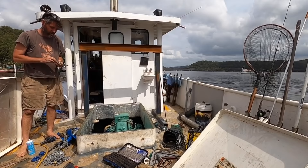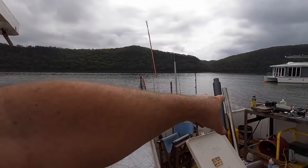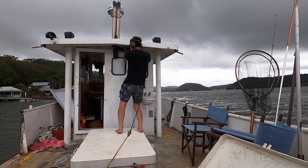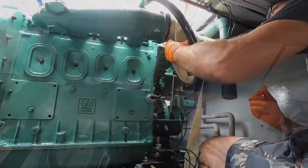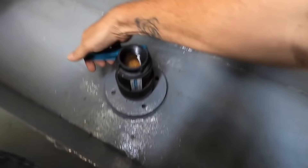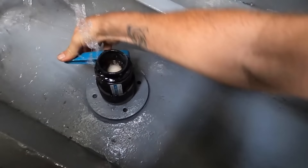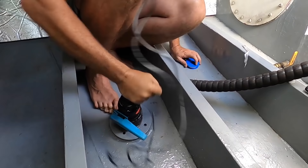First job of the day was to safely take the gantry crane down and then get on and start restoring the shutoff solenoid. This is the muffler — really tall and thin. You can see here, and being a two-stroke diesel, you can go straight through. Made it all the way to the end — and because I presume this end is going to be the hottest being closest, I'll just wrap back so we've got triple coating at this end. Just going to give this one a quick check, flush it out — there we go, a bit cleaner. They're all flowing nicely. I've just measured the pipe length I need — I'll cut that on deck and then we'll come and install it.